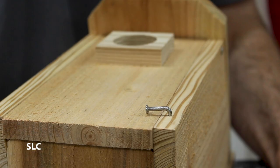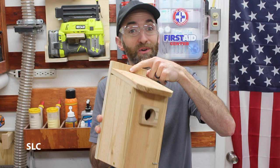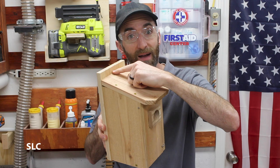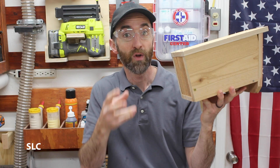The great thing about this birdhouse is you can mount it a couple of different ways. I left a little additional room at the top, so if you're mounting it to a wall or fence, drill a hole right through at the top and use a screw or nail, then open it up and drill another one down below so you have at least two fasteners holding it securely. In my case I'm going to be mounting it from the bottom — I have a pole out in the yard with a holder on it, so I'll be drilling some screws in the bottom and positioning it firmly.